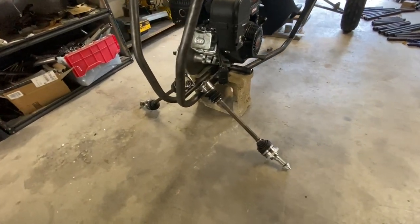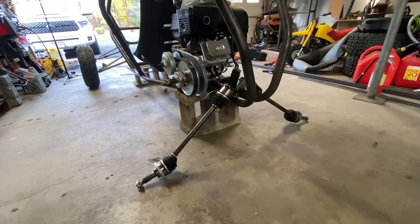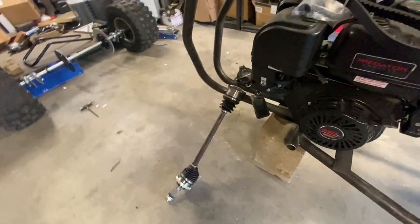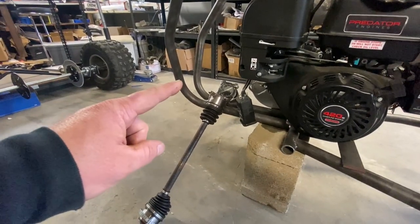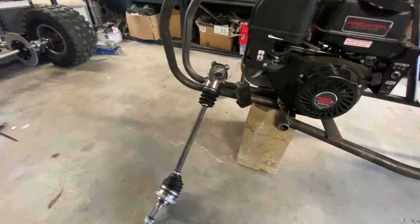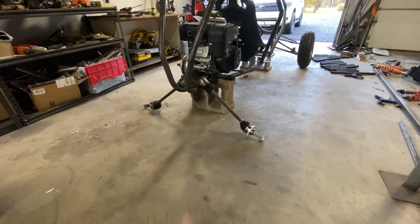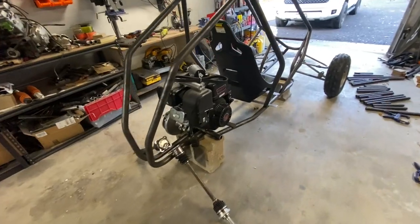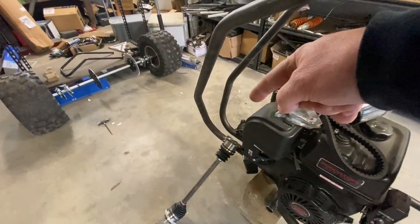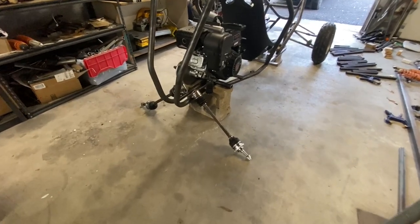You could also do a Mazda Miata axle rear end. I started a Facebook build group and some awesome ideas have come out of it — go check out JD's Garage, I'll leave the link in the description. He's shown how to build a center carrier for Mazda Miata axles and what hubs to use. There's also someone getting ready to make a sellable kit for a center carrier that takes Mazda Miata axles and sprockets and rotors off a common vehicle you can pick up anywhere.